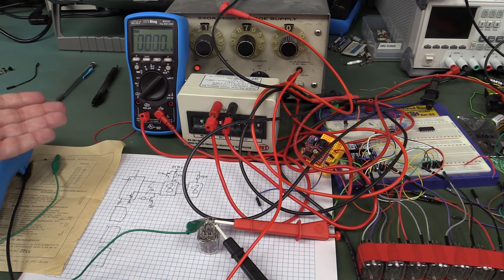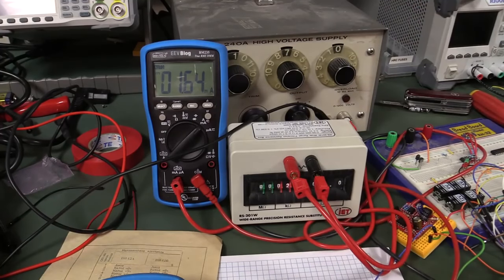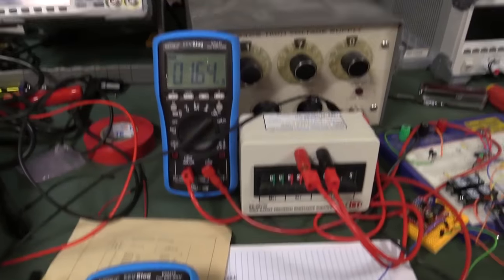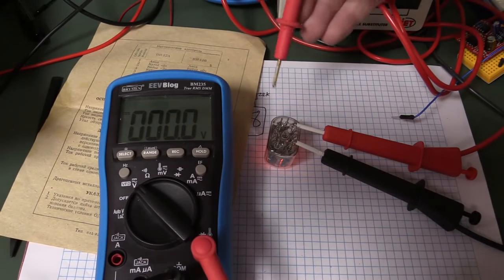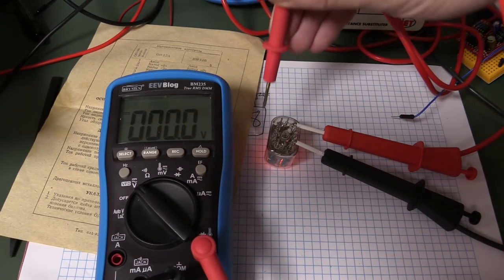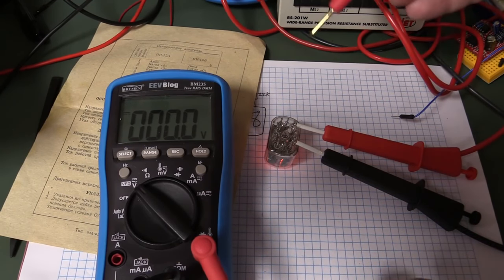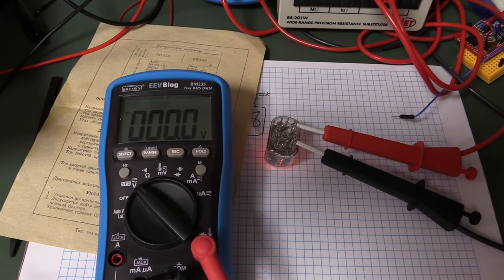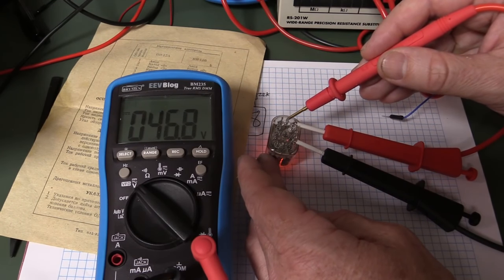Well, hey, we've got some Nixie tubes. Let's measure it. I'm powering the Nixie tube from 170 volts here through the 22K resistor nominal that I was going to use. And people wanted to know, what is the open voltage on the other pins, i.e. when they're switched off by the driver? And can you actually get away with a lower voltage driver, etc.? Well, let's actually take one here and let's go around and measure.